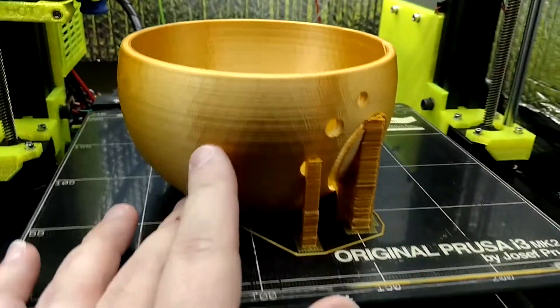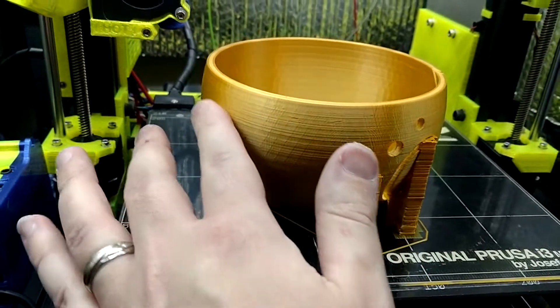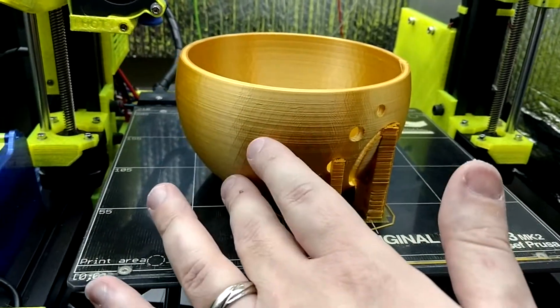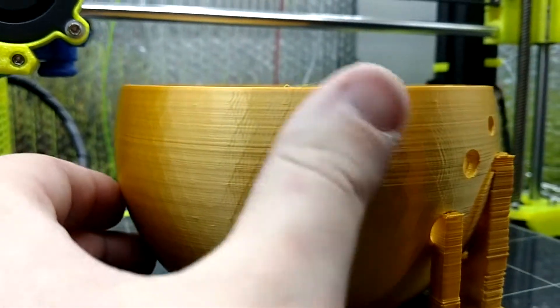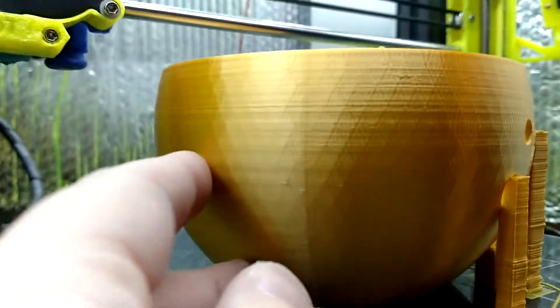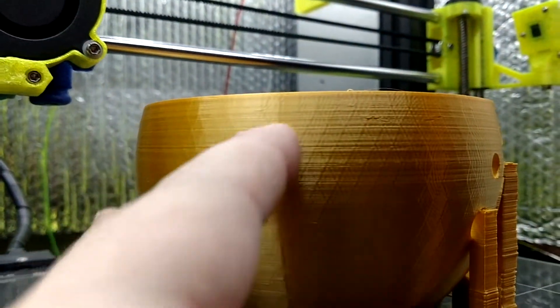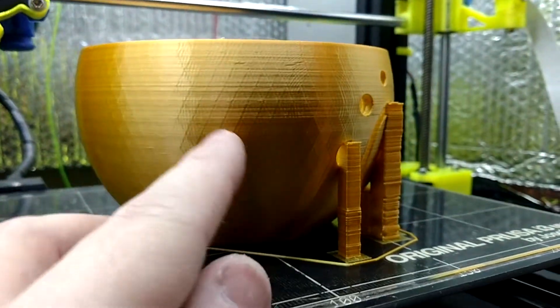What's kind of cool is that I used the cubic infill texture and a thin wall so that you could see it a little bit through the gold filament, and it shows up just barely. It was a really good decision, I think. It's just two perimeters instead of the usual three, and you can see what the cubic infill looks like from the side.